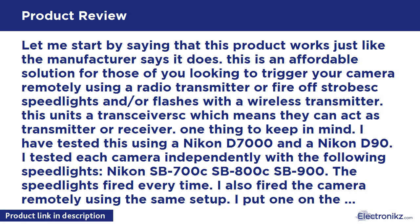Anyone worried about RF interference, it's a valid concern. I looked at both operating frequencies. The PW FCC USA version operates between 340-354 MHz. The Yongnuo RF603 operates at 2.4 GHz. The amount of space in the RF spectrum is so far apart that, unless the devices are physically touching each other, there should not be any interference or frequency drift. This is my opinion and experience. This information has not been professionally tested in a lab under controlled conditions.